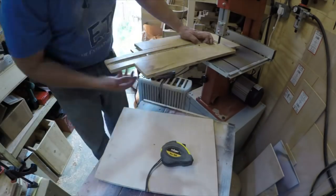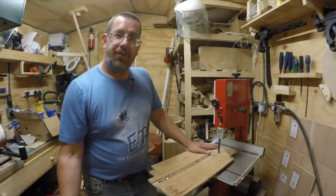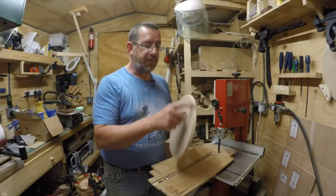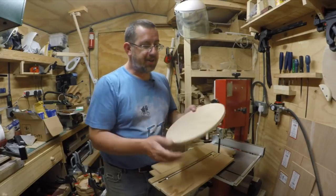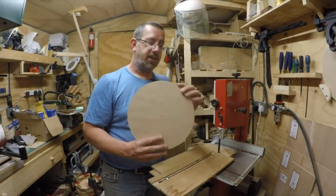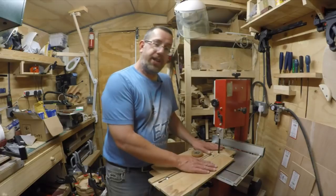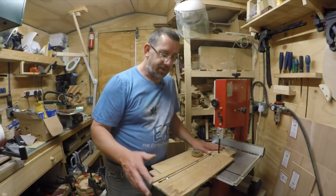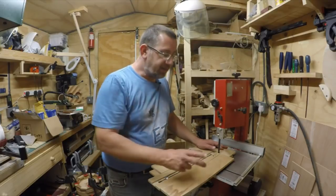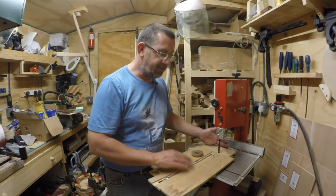As you can see, this is a 280mm disc which I've been reusing in a future project — very quick and easy to cut. First results: an almost perfect circle, with a very minor flat spot. You do get a bit of tear out, but as you can see I've just gently sanded back one edge and you get a really nice edge. For cutting a circle on the bandsaw this does work an absolute treat. The whole thing is literally made from off cuts of plywood I had lying around — all 12mm ply from a length I had in another shed, ideal just to cut up for this.